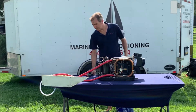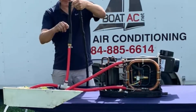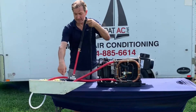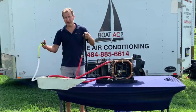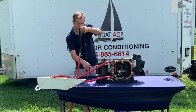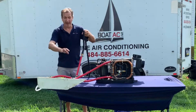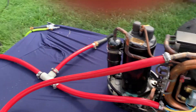The way I came up with it: basically we have a tee, and the garden hose comes in at 40 psi, going into the inbound unit, through the heat exchanger, back out the outbound side, and through the hull of the boat going out. Then we've got 120 psi of air pushing a water column through this tee — water's coming down through here, pushing the water column, and we can just blast the water out and all the debris.